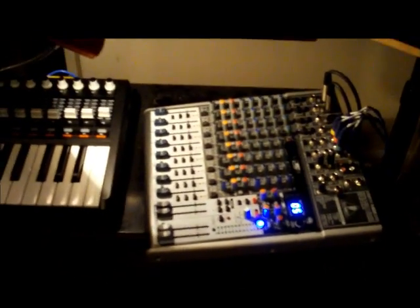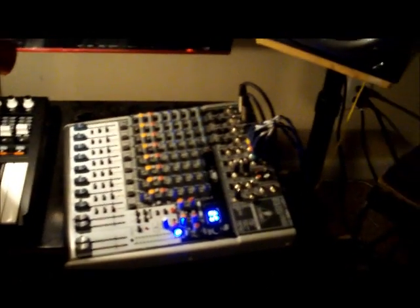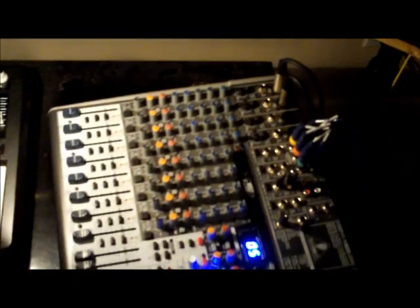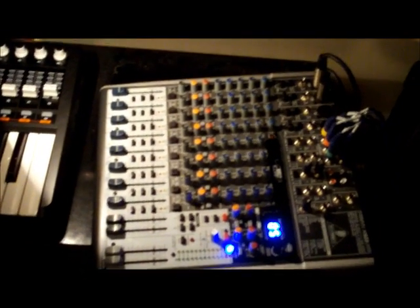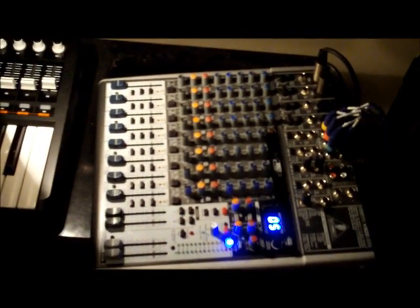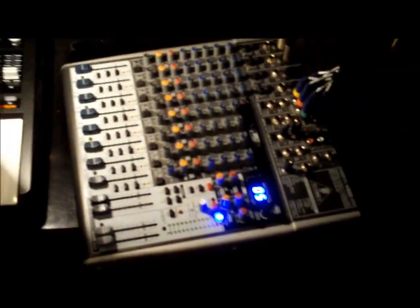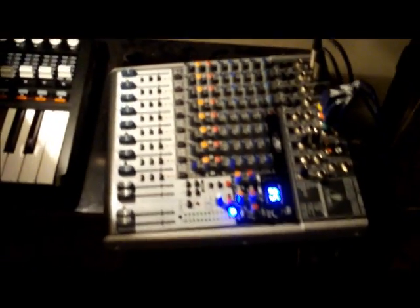So there you go. Now that you know you can use a mixer between your Driverack and your speakers, you know that your volumes could be more flexible. And like I said, you can plug a microphone into it, but make sure you hit the main or whatever channel you hooked up that would route into the main speakers only, not to the subs, to prevent rumble. So that can save you some time too.